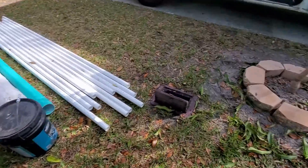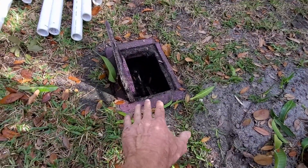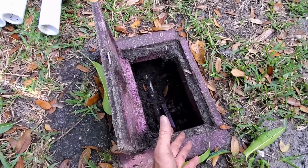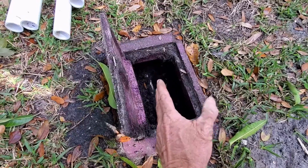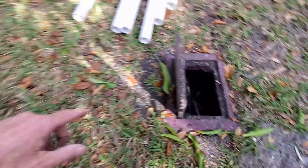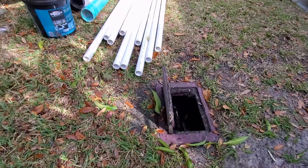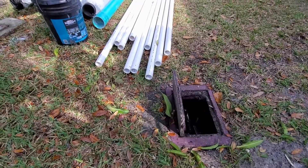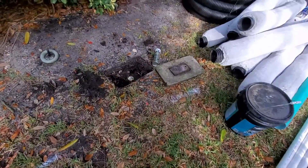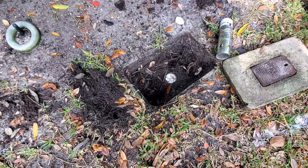They're just six to eight inches under the ground, so we need to make sure we can get to the shutoff in case we hit that line. There's a very big possibility that line's coming straight across the house and we're going to cross it a couple of times. This house also has reclaimed water for the irrigation system — you can see the pipe; it's less than eight inches deep and we'll probably cross that as well. We need to know how to shut that off, so I always open up the boxes on both sides so the guys know where they are. You could use vice grips to turn that handle and shut off the valve if you break the line.